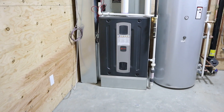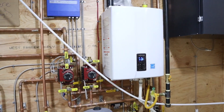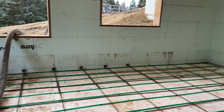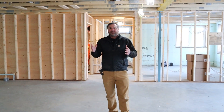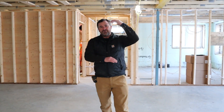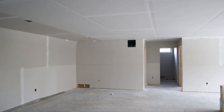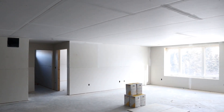If you look up, you can see that in a house like this we still do forced air furnace, and we'll do a boiler and run in-floor heat. It doesn't have to be a boiler, but those are all items that stay the same. This ductwork is custom because we used a two-foot flat open web truss. This basement is actually eight feet clear — no bulkheads, nothing.